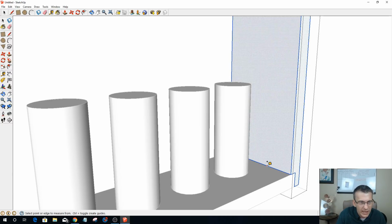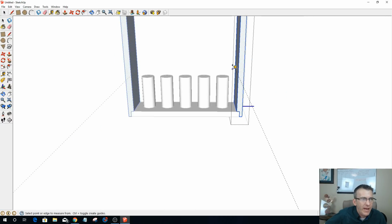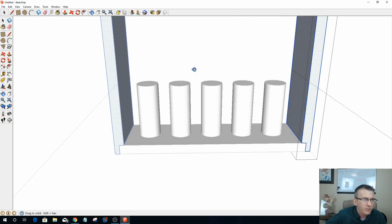So what most likely I'm going to do is, I'm at 4 3/8 here, so I'm going to go probably maybe 5 inches to the bottom of my shelf. That'll probably be good. And on my shelf, now my shelves are, unless I want in my 1/4 inch backboard to do a little groove, a dado or groove. In this case, let's see here, it's going across the grain, it'd be a groove.